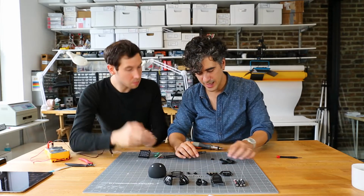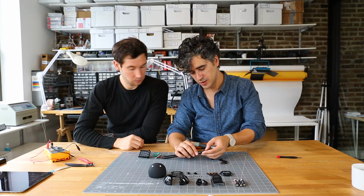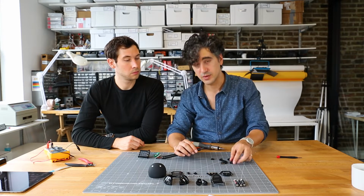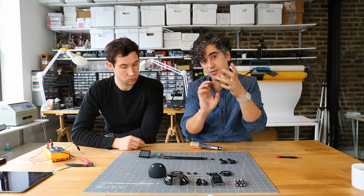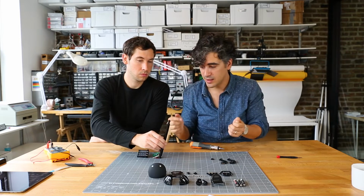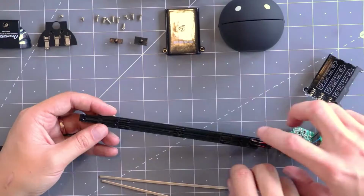All right, there's a little rubber gasket here, and all that does is it creates a little resistance on this, and it makes it harder for this to turn. That's a good lesson if you just want to make a product that has a little bit of stickiness in where it positions. You put a little EPDM rubber gasket inside there, and as it's compressed, it just gives it a little extra controlled resistance.